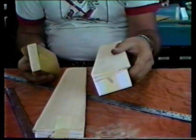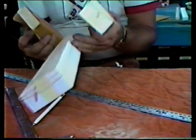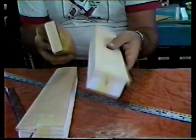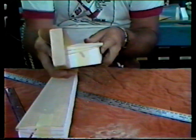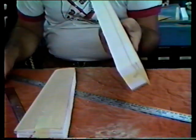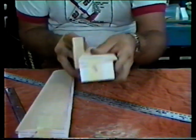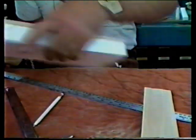What we did, we take the piece to the core and just sort out the hinge line. Of course, the amount is 1/4 and 3/8. That's going to be the leading and trailing edge. Once those pieces get matched up and glued in, that's actually the next step right now. Sometimes it's easier to glue these with the tapes right into the core. When you take them out, you can get the final sanding on them.